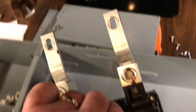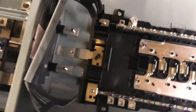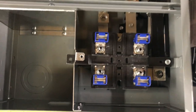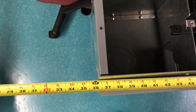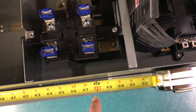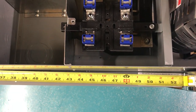This just simply lifts up and slides back, and I'll be replacing that with the remote circuit breaker. Remotely, I'll be able to lock out the mains from the meter base. I'll scope this out — it will end up being 36 inches off the ground.